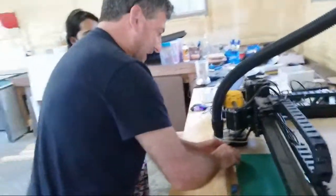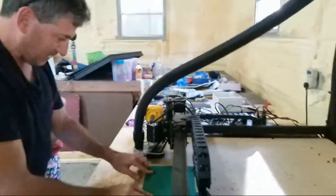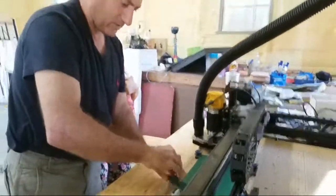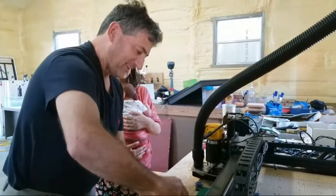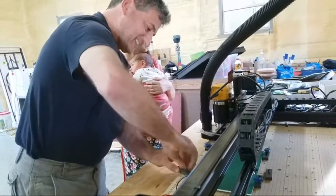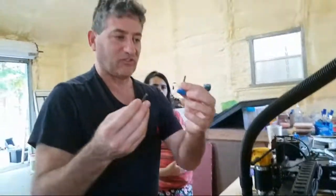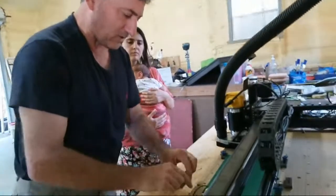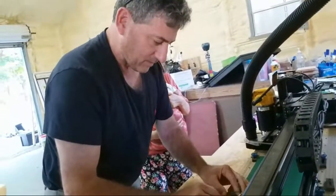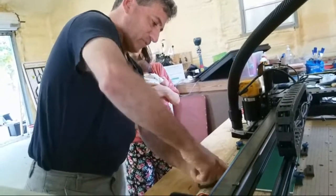So the Xcarve, you have these clamps here, and you have to be sort of careful where you set them up because the machine will grind through them if you don't set it up properly. So what I'm going to do is, and it takes a while, this is the little burden of it, screwing these things in and unscrewing them just takes some time. The blue ones are deeper, the green ones are shallower and are quicker. For the 1/4 inch, we can use the green ones mostly